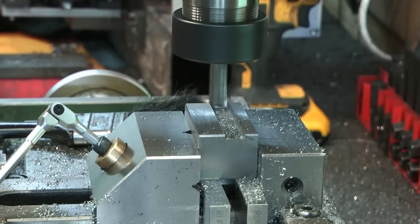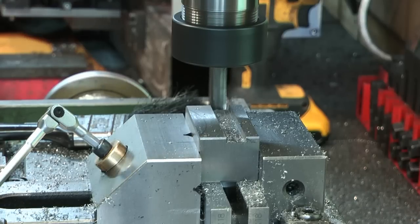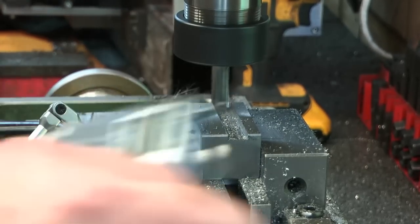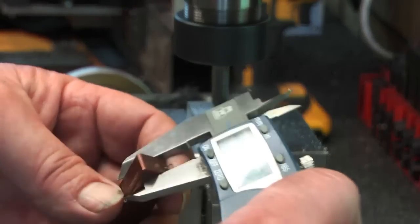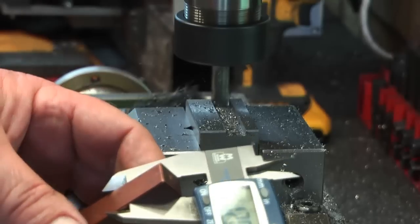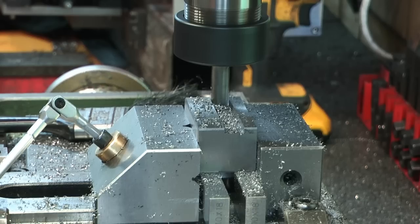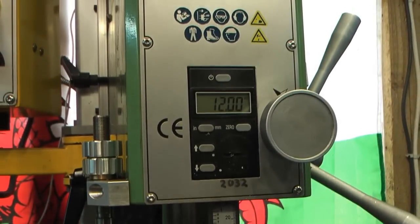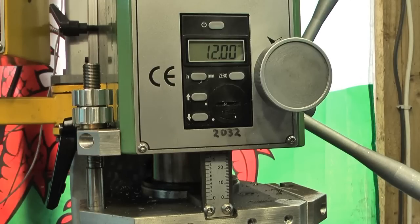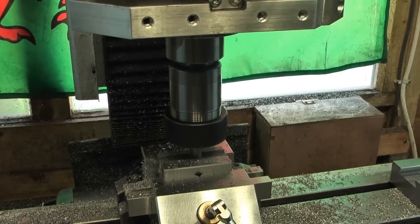I'm going to go to a normal 12mm deep. I might even just measure the tools and see what they are - I believe they're 12mm square. Measuring with the calipers: 12.01, 11.9 - yeah, 12mm depth will do. So we're on the last cut - you can see 12mm there. I've set the stop so we'll consistently come down to 12mm. It's only a 1mm cut on the last one because I started with 1mm and we're going to 12mm.